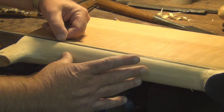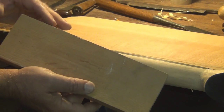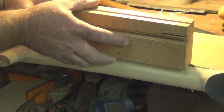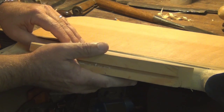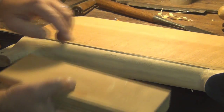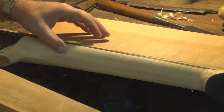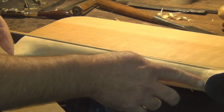Trying to keep this flat, a tool you might want to create is a flat piece of wood with sandpaper on it. I've cut this one about a half an inch, maybe three quarters of an inch short of the full length until I hit the heel down here. I shouldn't have to sand dead flat on the back of the neck or dead flat on the fretboard side, but this will help indicate where I've got a flat spot. I've got about a half an inch worth of motion — I can go this way and see the high points that the sandpaper is taking off and the low points where it's not. Since I'm shaping, I can even go sideways on the grain. That will make some scratches that will have to be taken out, but it can indicate more clearly, visually, where a low spot might be. My finger picks that one up real fast.